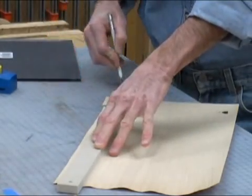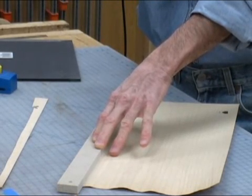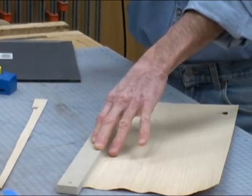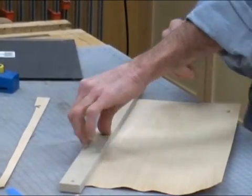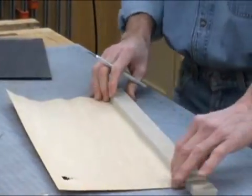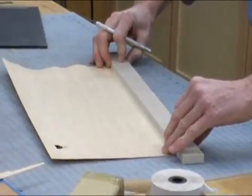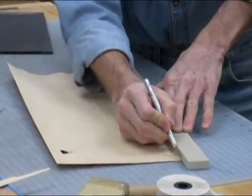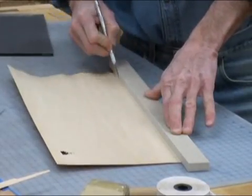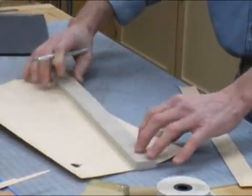And that's vital, that I didn't try in the first pass to cut all the way through the veneer, because the tip is going to follow the path of least resistance. And by making multiple passes, I have a lot less resistance from the grain. Okay, so once you've got your bark edge off, from there, come back and cut strips exactly the same width as your straight edge. And I'll do this in a multiple of 4 to start with. Okay, so there's one.